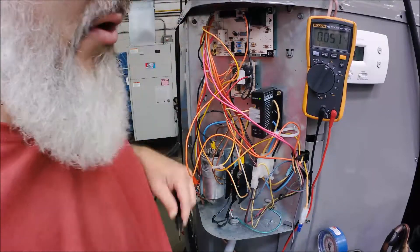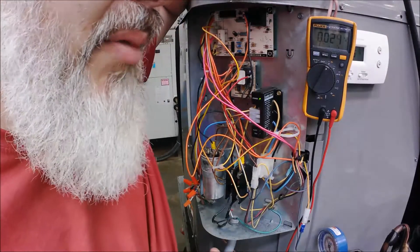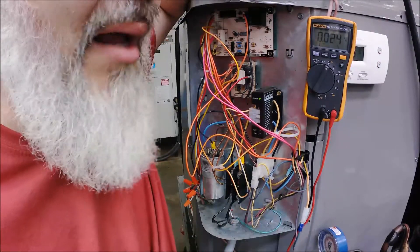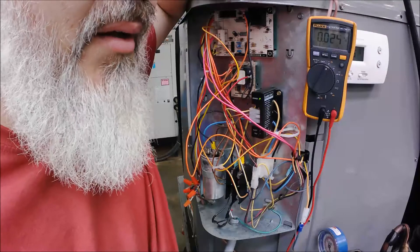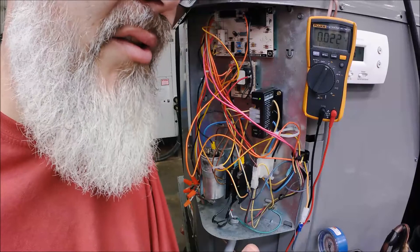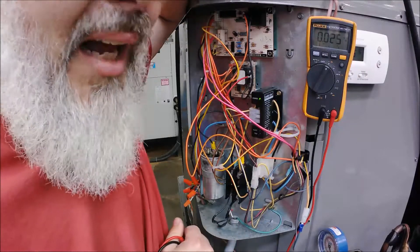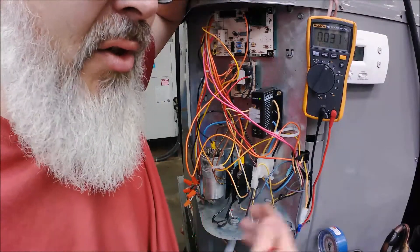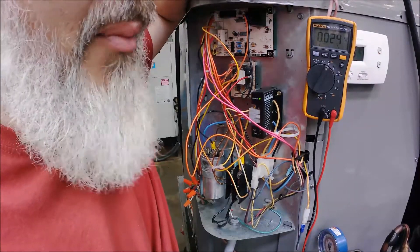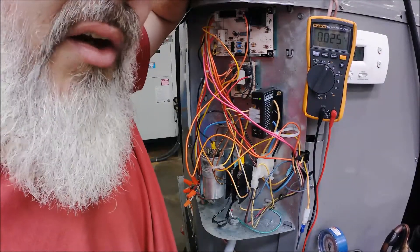In this particular case, they were trying to charge the unit with refrigerant - they thought it was low. As they were charging refrigerant, it kept cycling on and off, and they had enough sense to stop before they overcharged it. A lot of technicians would get caught up thinking it was the low pressure switch turning it on and off, but in our case it was actually the high pressure switch cutting it off. That tells you there's another problem, and hopefully the pressure switch was working properly.